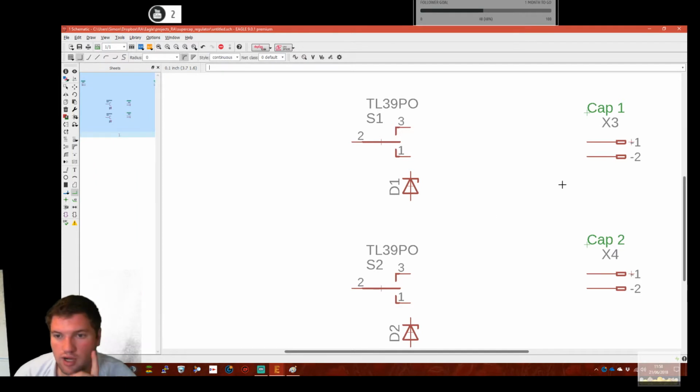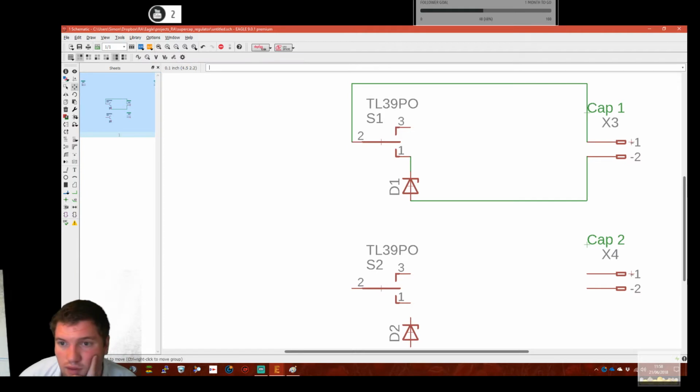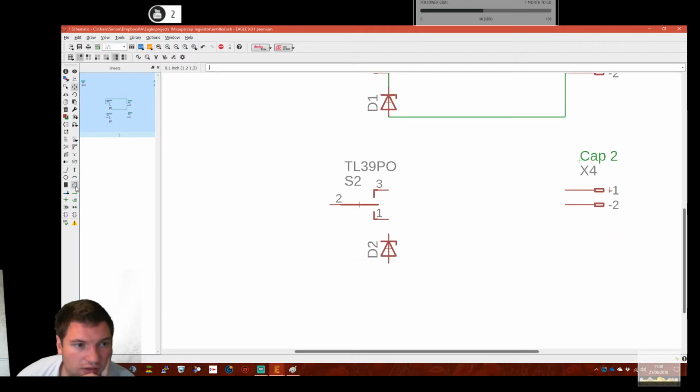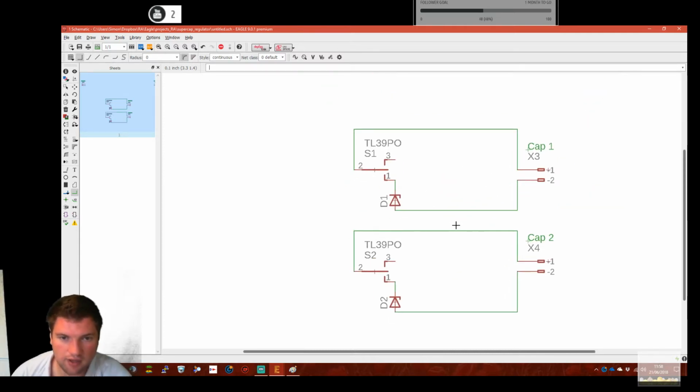Well, let's get some wired in so at least we can see it. We can play about with it. Zener goes through there. That's going to be the common. So that then comes back down to here. Okay. That's the sort of theory of operation. So now, right, if these are 2.5 volt Zeners, for example, we can protect it with that.